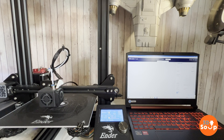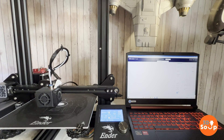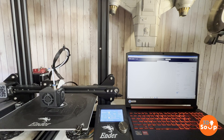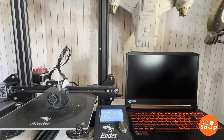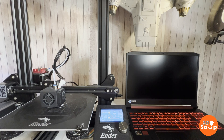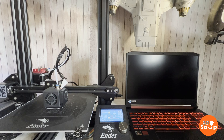Just a quick aside - a lot of places will tell you that if your computer goes into sleep mode or if the monitor shuts down in the middle of a print, it stops the print. As you can see, my monitor went into sleep mode and had no detrimental effect on the print whatsoever. But your mileage may vary with that - it depends how you've got it set up. If it actually went into proper sleep mode it would stop the print, but just going into hibernation like this doesn't seem to be a problem. Print is still going ahead, and it hasn't affected the print in the slightest.